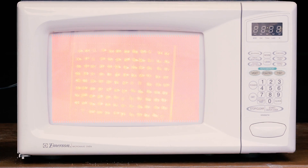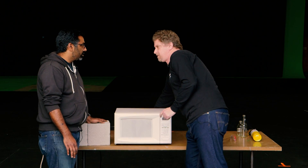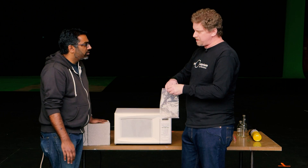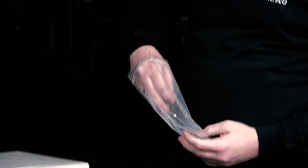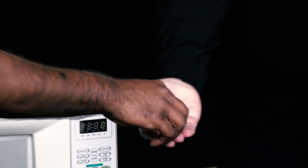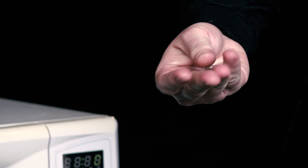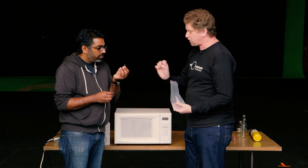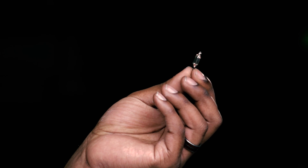What kind of light bulbs are in there? Those aren't regular light bulbs — these are neon indicator lamps. Sometimes you'll see them in light switches to know that you've turned them on. These little guys glow that reddish orange color. They're just filled with a little bit of neon gas, and they have these two little metal plates in there. We can drive the charges back and forth between the two plates and make the neon glow.